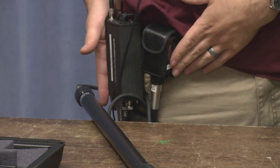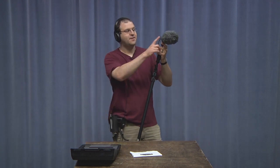So what we have done, we've got our shotgun mic on our boom, plug the boom into the MM1. So right now I can hear exactly what this boom mic is picking up. And on the tail end of the MM1 we've got our wireless transmitter. Again, we've got that pad cable dropping the line level output of the MM1 to mic level, which is what the mic receiver and transmitter unit need. Okay. At our camera, we've got the receiver plugged into one of the mic inputs just as if it was any other wireless mic. And when we do that, we've got clean signal at the camera.